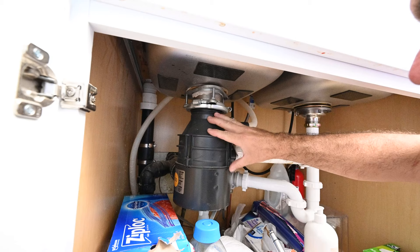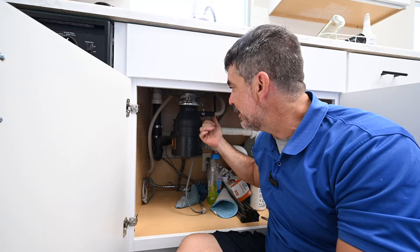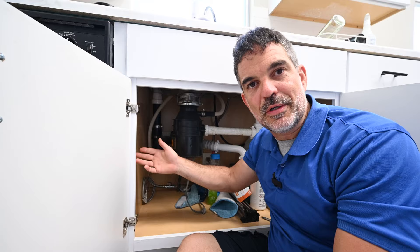So water, even if this gets clogged up, it doesn't flow back into the dishwasher. This should be done either way, whether it's the water inlet valve or not. Anytime somebody installs a dishwasher, there should be a high loop, whether or not there's one on the side of the dishwasher.